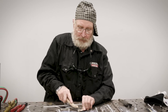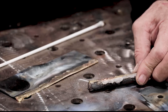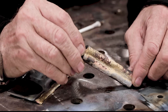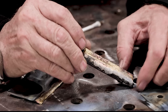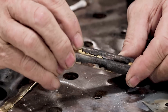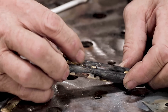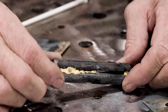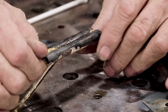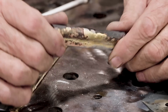Let me run the wire brush on it a little bit. You can see how small that is where the bronze has gone inside there. But if you look on the back, you can see how it's penetrated through with that capillary or wicking action — so it's got a lot of area that's touched there. It didn't make it all the way through here because we were moving a little faster on that end. I hope that shows just what brazing can do. I'm not even going to try to break this one because I doubt I can — I'd need a really big hammer.